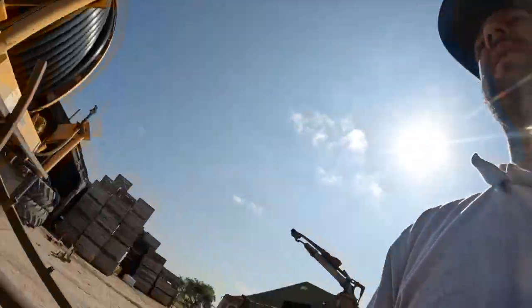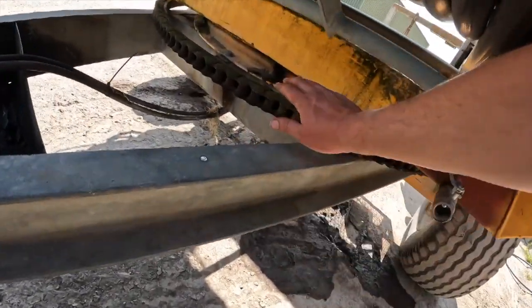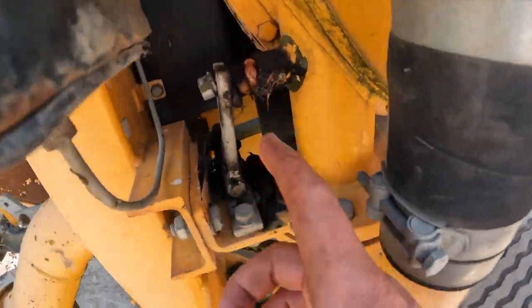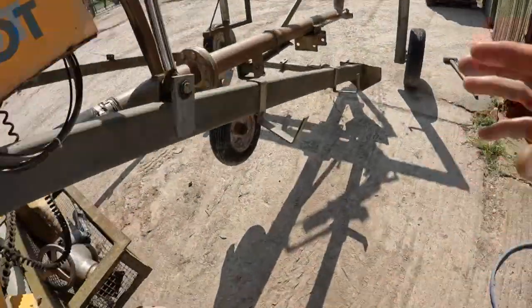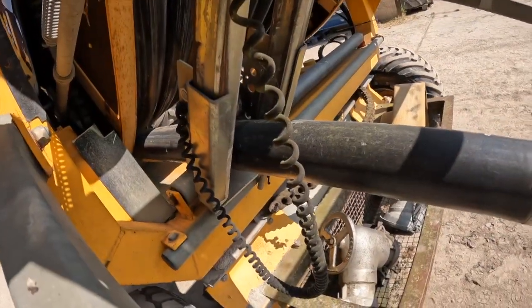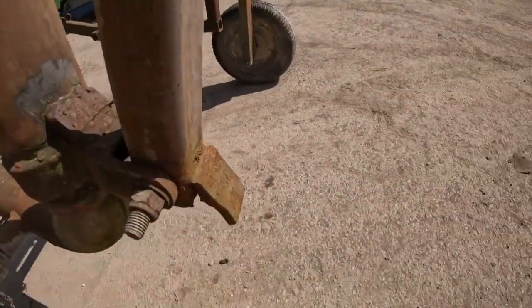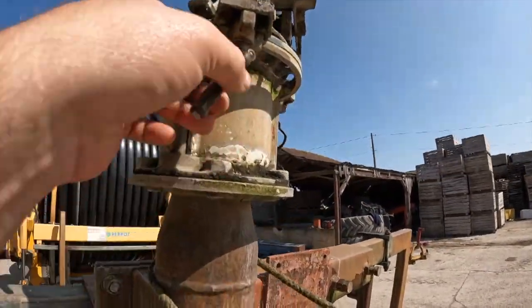Right, where was I? So, going through it from front to back. Obviously, you've got a valve there to shut up. That opened when I blew it out. You've got grease nipples on the turntable. You've got where the valves go in and out to shut the turbine up and down. You've got grease nipples on there. Plug the valves in. Check the wheels. Check the wheel bearings. Greased them all up. You've got your runner here for your metering unit. I've greased that up. And one more thing I've got to do that I noticed is broken is this got hit last year, so I've got to smash that down and weld that up, but we'll get it backed in. I've also greased these up, so they're grubby now.